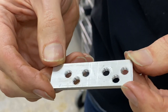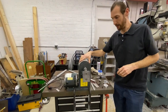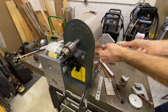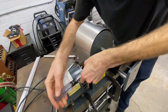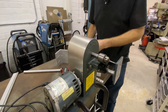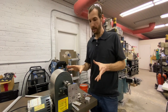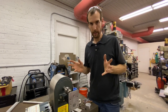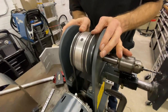Very fast and very easy — six holes really fast. Of course you want to be aware and set yourself up to do things safely. There are lots of different ways of tapping and lots of different reasons for doing those operations the way you choose. As far as precision and quality goes, I'd put this machine in the middle: you've got precision CNC-run taps as the high quality standard, thread milling which I think is even better than running a tap in and out of a hole, then this machine in the middle, and then tap handles at the lower end. Different ways of doing it for different reasons.